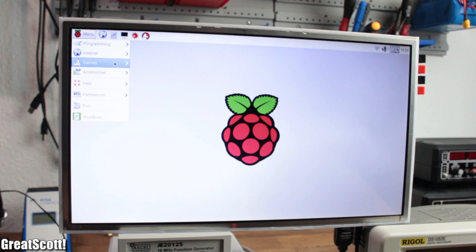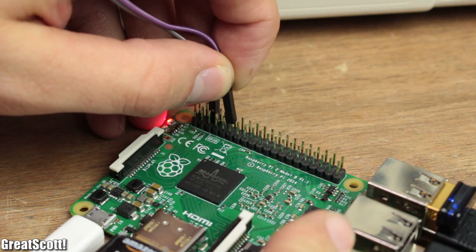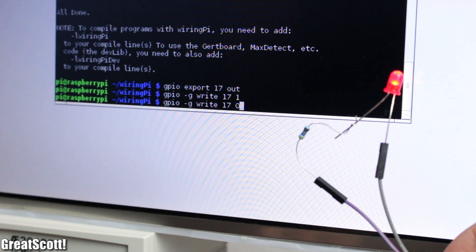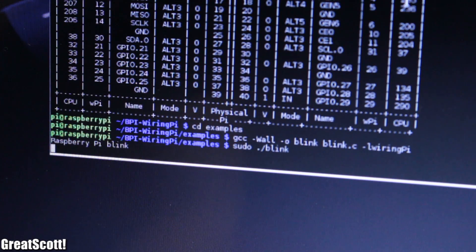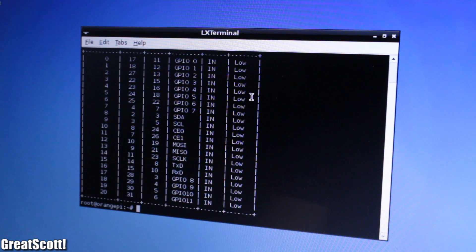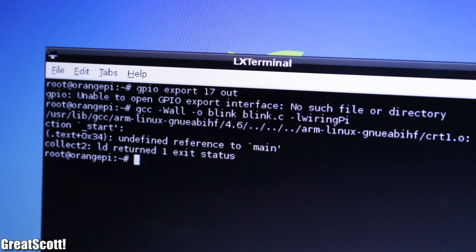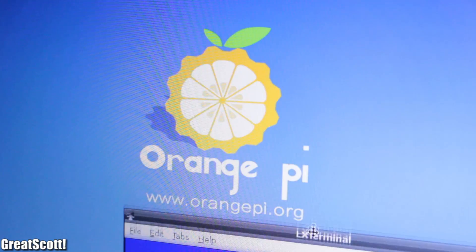The Raspberry Pi offers great Linux-based software, which is excellent for electronics projects — especially because of the WiringPi library. After installing it, you can use the GPIO pins in a similar way to an Arduino. The Banana Pi developers ported this library quite well and it functions without any problems. The Orange Pi, however, just pretends to have it installed while no commands work at all — they essentially copied the software from the LeMaker BananaPi team without doing a decent job of hiding it.